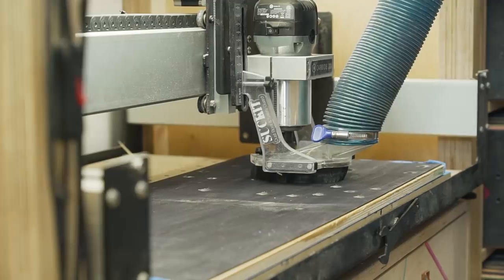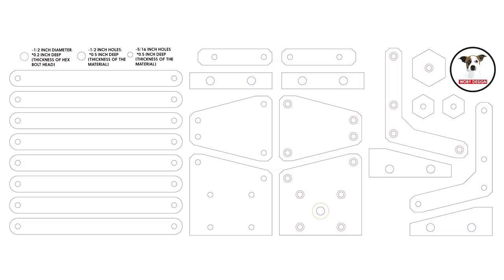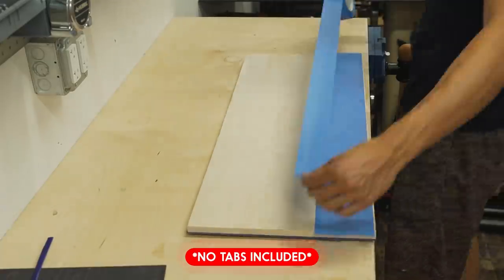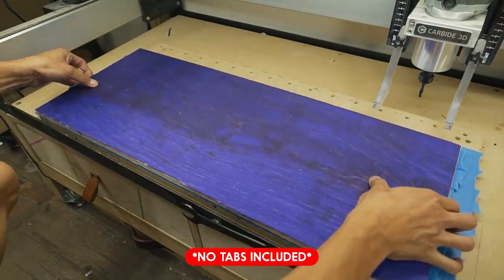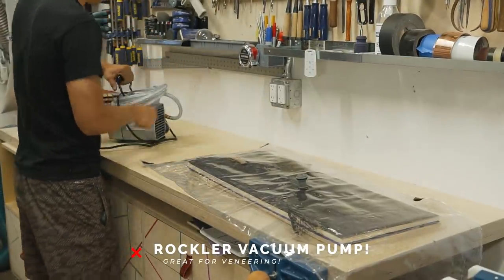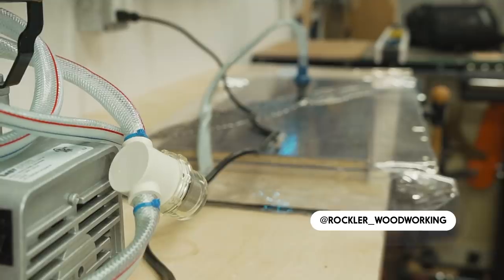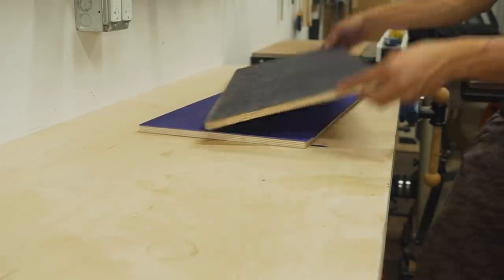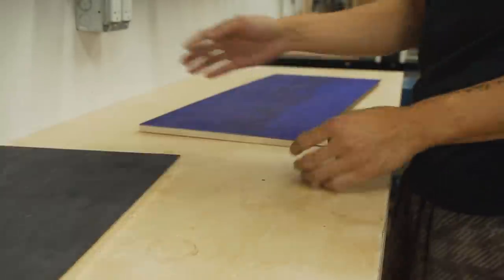The easiest way to cut this jig is using a CNC machine. On the SVG file, I wrote down exactly how deep you need to cut your circles. I like using the blue tape method, but you can always add tabs accordingly. The total cutting time takes a little less than an hour. Mine looks a little more colorful since I decided to laminate some veneers using this vacuum pump from Rockler. I'll be diving into more detail about this vacuum pump, so stay tuned for my next video. This is completely optional, but it's just one of the ways to level up.